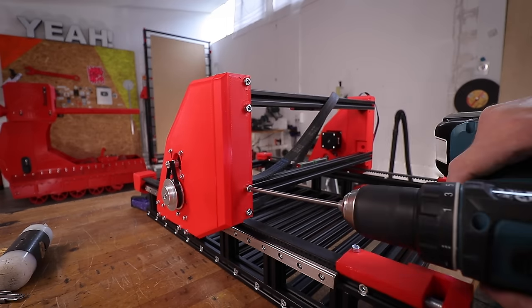This one in here is the calibration cut, which is around 0.25 mm off, because this should be 10 mm. And this one in here is after doing the calibration, which is, as far as my calipers let me know, just perfect. And now that the machine is calibrated and I made peace with the couch engineers, let's try something a little bit more difficult.